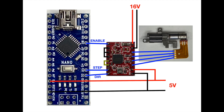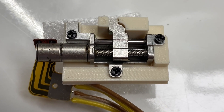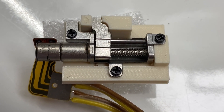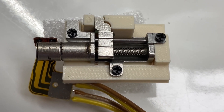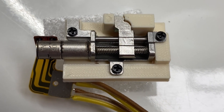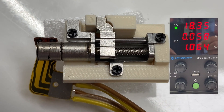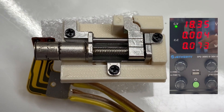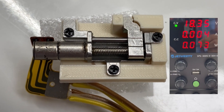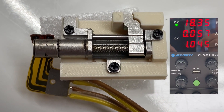The stepper drivers are powered with 16 volt. Driven this way, the motors are very powerful. There are several hobbyists who already use these steppers to control switches. Here with some images where these motors move. Note that the bracket does not yet have a limiter that restricts the movement to 3.5 millimeters. When the motor is running, about 60 milliampere is used. This is an average value. On the A4988 stepper driver PCBs, I capped the maximum current at 400 milliampere.